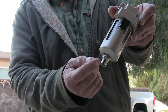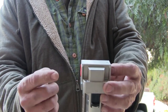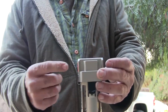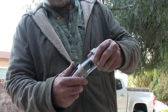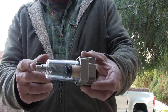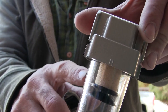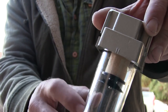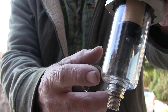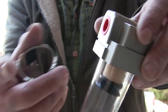It's got a drain on the bottom. It's got air in, air out. This would go to your manifold so you don't get any oil into the intake. That's what it looks like — it's got a little filter in there. The air goes in through that filter, whatever's on there drips down to the bottom of the container here to the reservoir, and cleaner air gets sucked out the other tube.